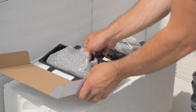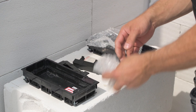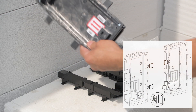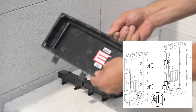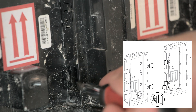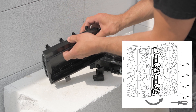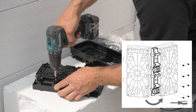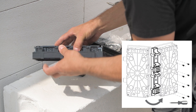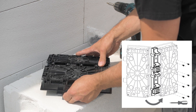Each box contains a plastic packet with separators, cable protectors and screws. Connect the two separators so that the foam tab goes at the top. Break off the inner anchoring brackets as they would get in the way. Push through the tabs here to make a hole for the connecting cable. Attach the two separators to the first box and tighten the screws at the rear. Insert both cable protectors, then click the second box into place and tighten the rest of the screws.